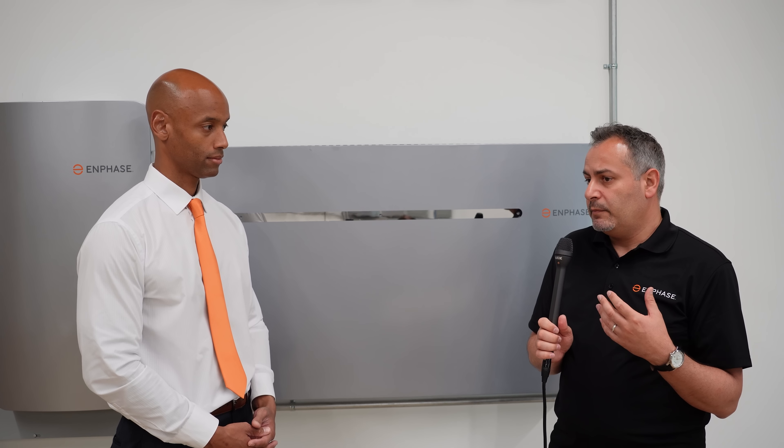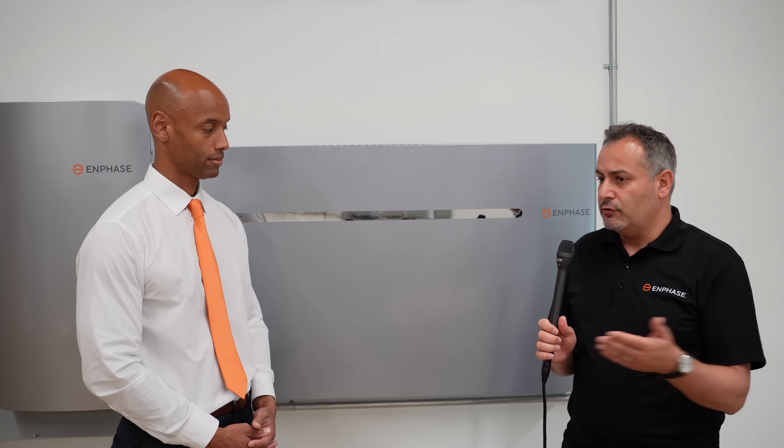The other thing is that the batteries we have are modular. We pick the size such that it can accommodate small, medium, or large systems, because of the AC-coupled nature of these batteries and their modularity. They allow you to address any job — from having just one battery on site to having even 12 batteries on a regular installation with a system controller. You don't always need a large battery for every job, and sometimes power limitations mean you pick the smaller one. If you need more, you can install more.